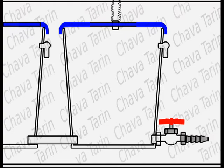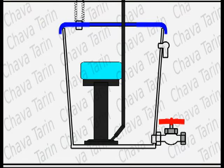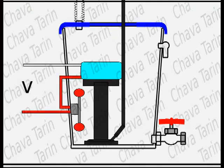As an addition to this system, although it makes it a little more complex, you can install an electric pump of the type used in swamp coolers to pump the water up to an elevated tank. You can use a manually operated switch to turn the pump on when the can fills and off when it runs out, or automate this using a switch with a float or sensor.